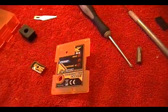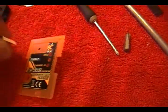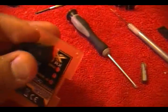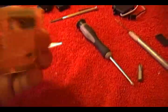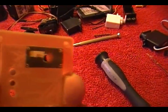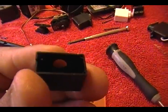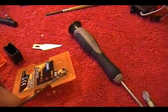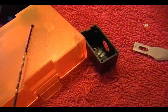I took the plastic sticker off of there so that when you put this box over here it will snap on place on the corners of the plastic. When you flip it over you can see clearly the plastic, and you can see the holes I put over there because I was able to see those little holes on the corners of the servo box. I used a tiny drill bit and just put those holes there - a little bit smaller than the servo box screws so it will grab.